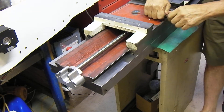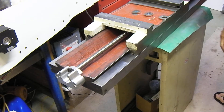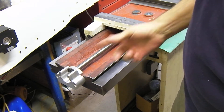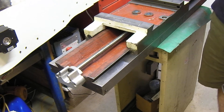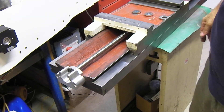I didn't put the greaser on yet. Eventually I want to get an extension on the greaser so it'll stick out here so I can get the grease gun on it easier. There is enough room in here where I can get the grease gun underneath and give it a squirt. Normally I would run it back and forth — you've got the nut on the end, you can put a nut driver on it, run it back and forth and check for binding. I've already done all that, so this axis actually works really well.